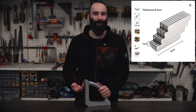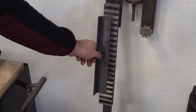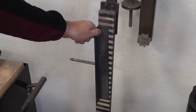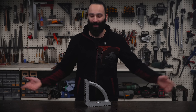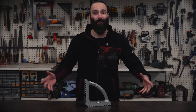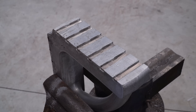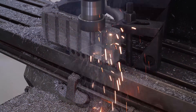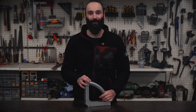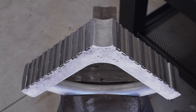The main one is that the magnets I got are weak. In the past I built another similar magnetic fixture using the same type of magnets and that one turned out very strong — you can actually see that this design is heavily inspired by that older project. But the magnets I got this time are just not as good. I tried to improve the overall strength by reducing the gap between the magnets and the surface of the square, but that led to a few defects because I accidentally cut into the magnets on one side. Then there wasn't enough space for the epoxy to fill and cover everything, and that still wasn't quite enough for strength, so I ended up doubling the amount of magnets per side, which definitely helped, but still not amazing.